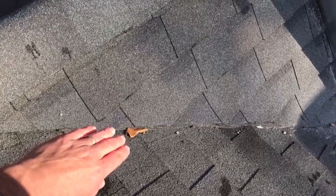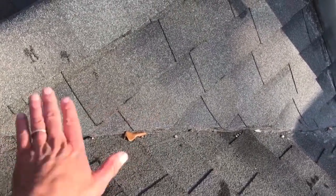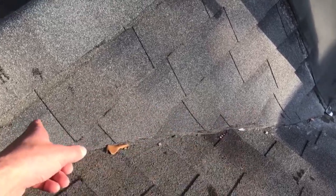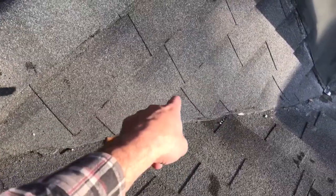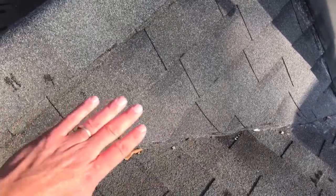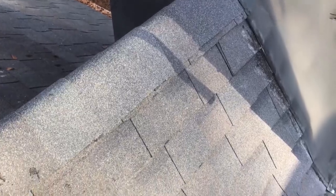They recommend before you lay these shingles, whichever shingles you lay on top of the cut joint, you go ahead and run your bead of black cement. So underneath all these right here, I should have run a big bead of roofing cement right before I laid them. What else? I still gotta go back and patch this shingle in I missed here.